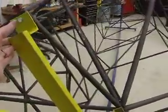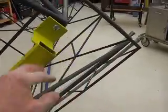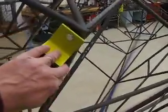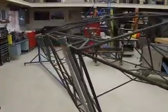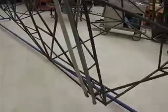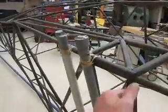The other good news is that it turns really easy now that it's counterbalanced. I can just go ahead and move it anywhere I want and it stays. All I have to do is just flip it around with my hand — hardly any force whatsoever — flip it around, and there it is. I can weld in a comfortable position, move the stuff wherever I need it, and when I'm done, all I've got to do is uncap the ends, pour out the lead shot, and save the tubes for another day.